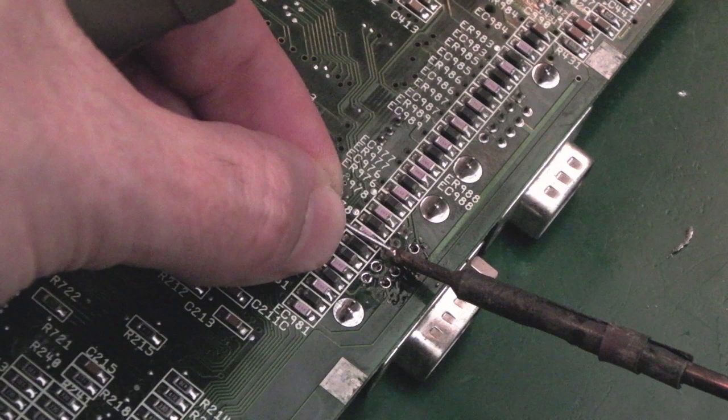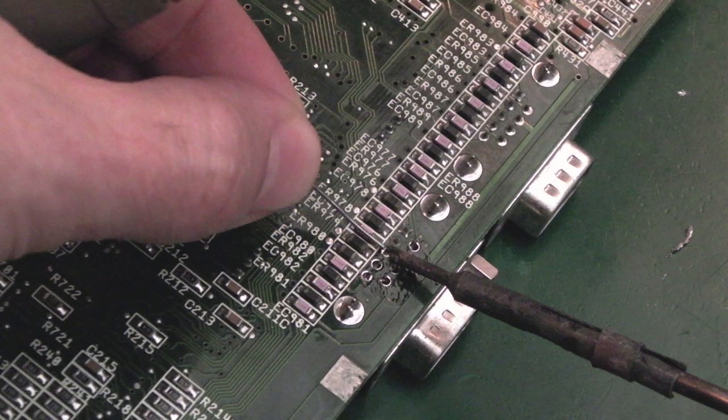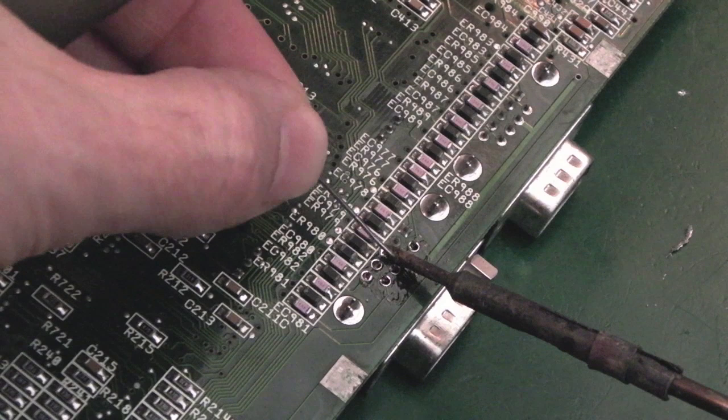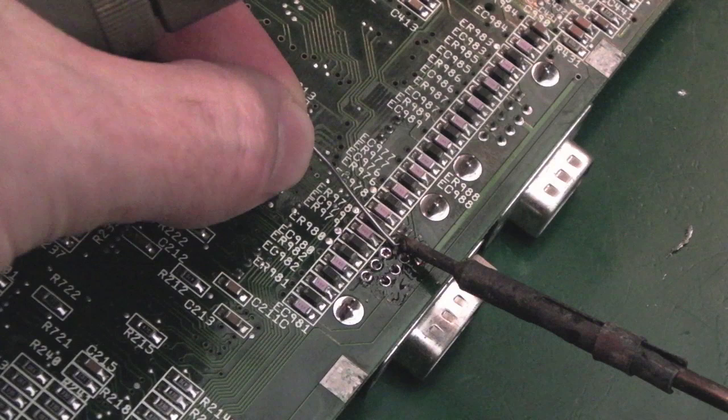Now, the interesting thing with the mouse, because I'm using a mouse adapter to a PS/2 mouse, the thing I noticed, it wasn't working at all. I looked underneath and the LED is not on the mouse. There's like a red light underneath when it's powered. And I wiggled the connector around and then the LED came on. And then I found I didn't have horizontal, which is exactly what Chris was saying. You lose the horizontal. And I noticed wiggling the port seemed to make a difference. So I think we've just got a bad connection.